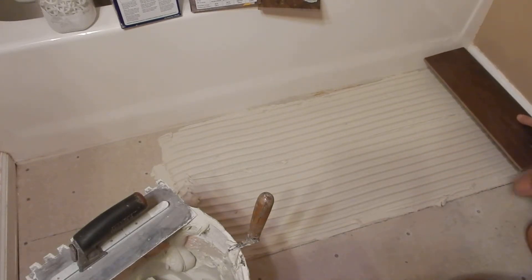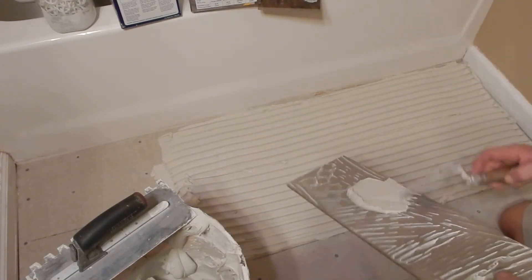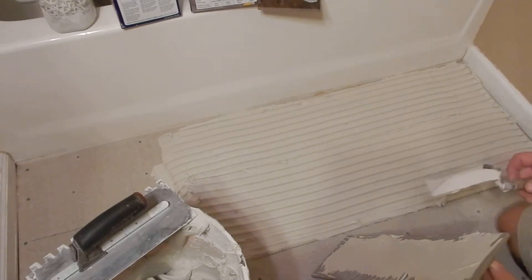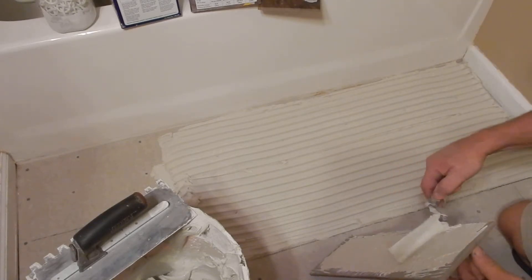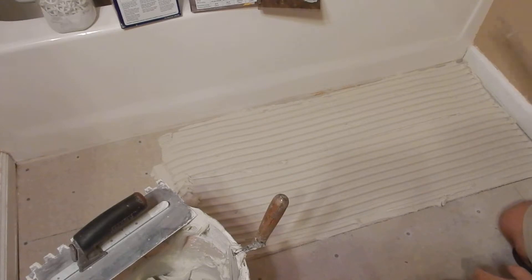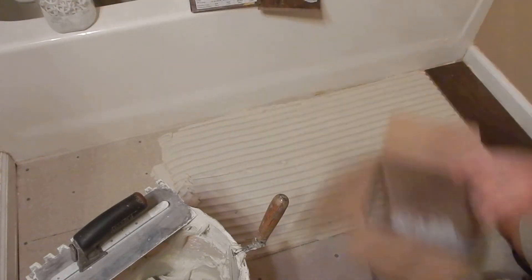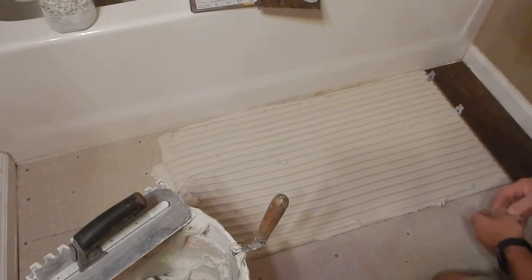My first tile is going to go over here — I'm going to match up this edge to the horizontal line. Because these are such long skinny tiles, I need to put some mortar on the back of the tile as well. I'll get it spread out; this stuff is very sticky so those ridges will stick immediately to the bottom of the tile and give me good integrity. If I don't do this there's a good chance the tile will not bond all the way across the whole length. I'll put this down, work it in with the corner lined up, then place clips near the top, in the middle, and down toward the bottom.